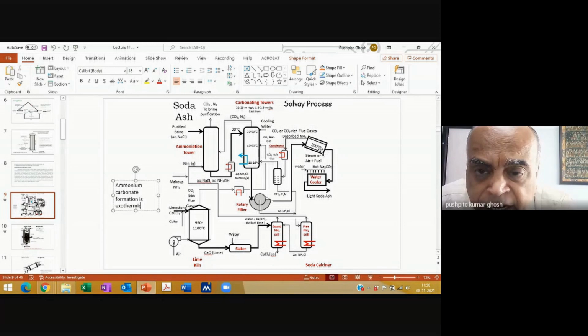See, I need a rich source of carbon dioxide. In my decomposition of sodium bicarbonate to form sodium carbonate, if I take 2 sodium bicarbonate, there are 2 carbonates, right? And at the end, when it becomes Na2CO3, I've got 1 carbonate. So the other one was released as CO2. Now, if I do an indirect heating of this, one is that I will make a pure product. There will be no contamination coming from anywhere. And secondly, because there's nothing else, the only gaseous substance that is coming out is my CO2, and traces of ammonia plus moisture, etc., which will all get absorbed in this aqueous phase. And so finally what will come out in the gas phase here will be just CO2, a rich source of CO2.